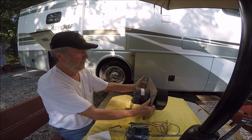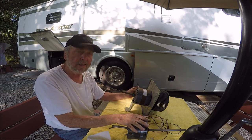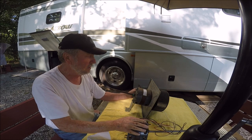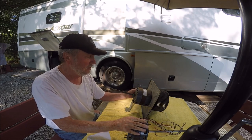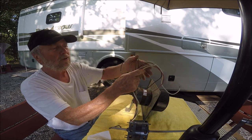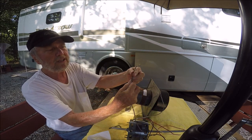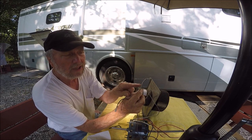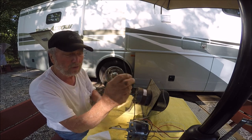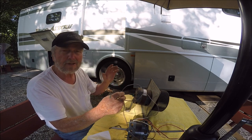Once you've pulled everything loose, cut your wires off but leave the pigtails attached to the connections so that later when you take the new motor up you can match up the wire colors. I leave those pigtails on and put fresh connectors on. It's pretty easy unless you're colorblind — brown and black look very similar, so you might want some help. When you get the new motor, the capacitor leads come with spade clips. It's very important to match the striped white and the solid brown to the correct terminals — it's polarized, so take a picture before you do this.